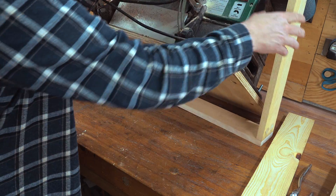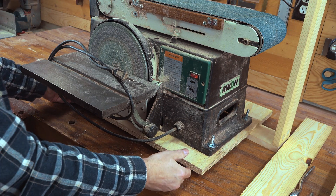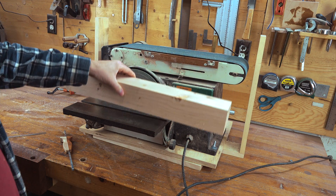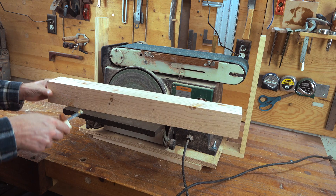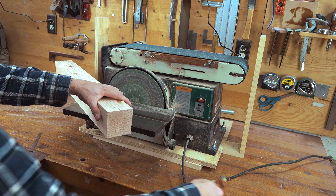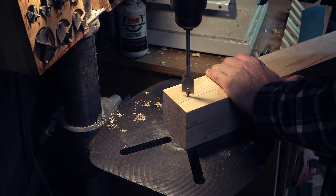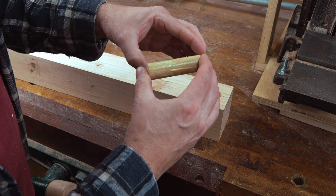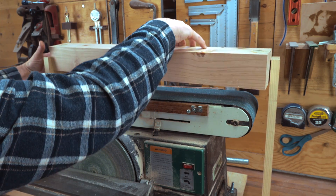We'll slide the walls and the base that we just created underneath the sander, and we'll also slide that second piece I talked about so that it's balanced. When I go to put this in, it's going to go in just like this — this is the side that I waxed. I'm going to bring this down and grab my marking gauge, move it to an inch and a half, which is the center of the stock, and draw a line across like that.